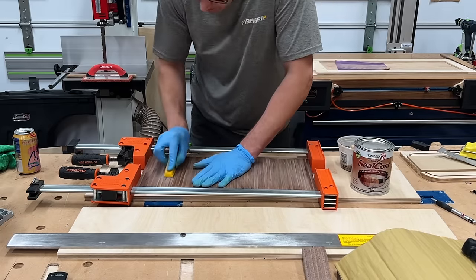Then it was time to do the repair. I was going to do a patch — basically just fill this in and you'd never see it. Unfortunately, anytime you have a cross-grain patch, you always see that seam, but I figured I'd make the attempt anyway. I put one little strip in there with some CA glue, slid the other strip in on the other side. Once that was dry, gave it a light pass with a block plane, hit it with a random orbital sander — not great. So I decided to get crafty, and in an homage to my buddy Nick Key at Key Woodworks, I went back into Adobe Illustrator, made a patch, put it back in the Shaper, and came out with a custom design. It's obviously not an exact match to his logo, but an homage nonetheless. Here's to you, Nick.